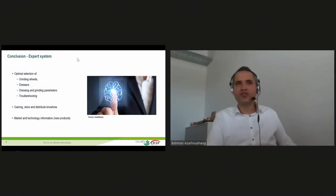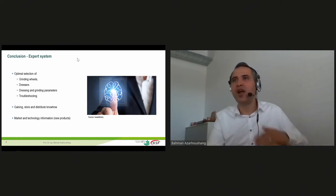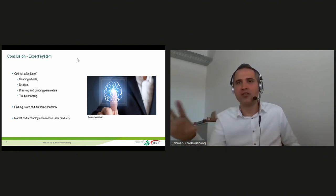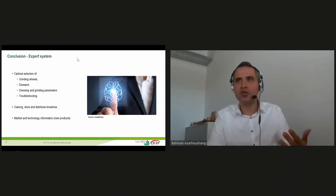Really great question. Thank you, Stefan. Also, thank you for having me today. We tested it prior to launching the first phase. So we did a survey. We defined a process and asked 10 different, really high skill operators, the persons who are doing the grinding process on a daily basis regarding cylindrical workpieces. We gave the information regarding the workpiece geometry, the hardness, and also the required dimension accuracy and surface quality. They had the task to offer us different grinding parameters and also the suitable grinding and dressing tools that they think could actually be useful for this process.